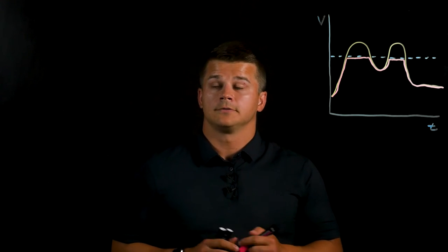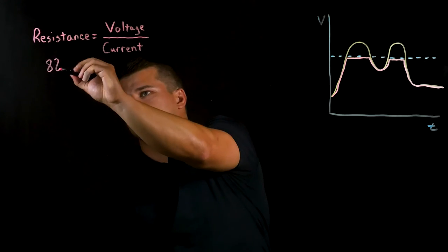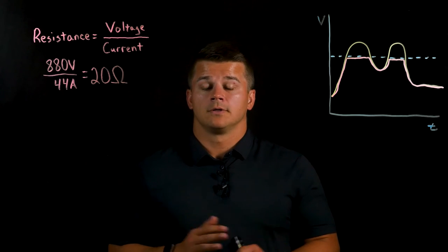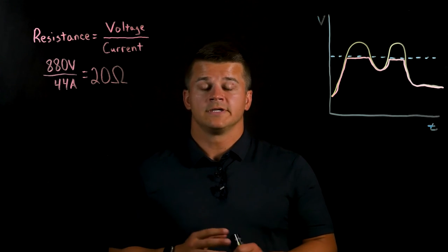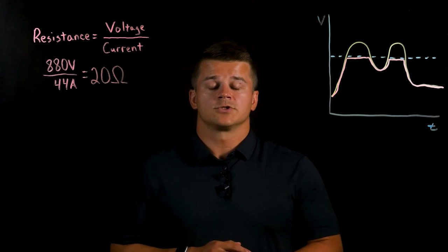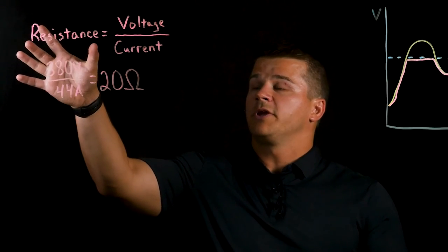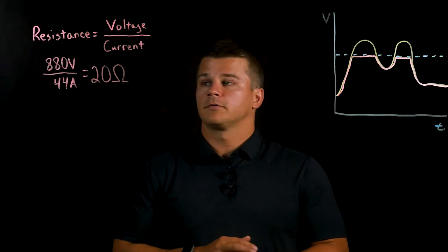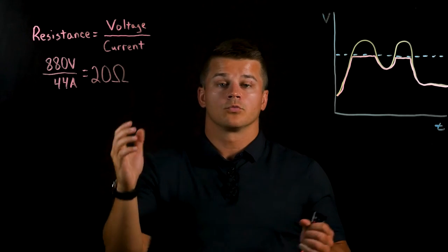The first is the resistance value. The reason we have to first talk about the resistance of the braking resistor is actually due to the braking transistor — not the braking resistor, but the braking transistor. The braking resistor is external to the drive. The braking transistor is internal to the KEB drive and is what switches the current on and off to the resistor. To calculate what we need for resistance, we look at the basic electrical equation: resistance equals voltage over current. Within this application, the voltage and current are known values, so we can calculate the resistance.